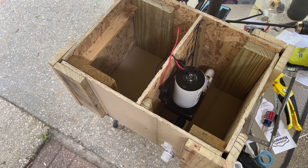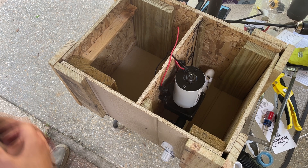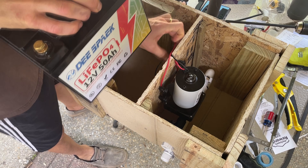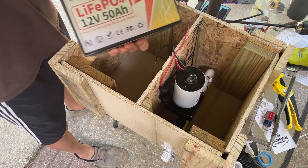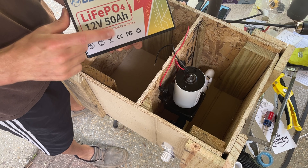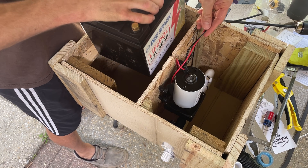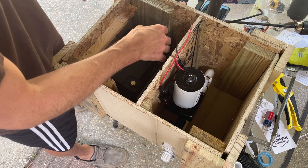Now that we have the pump and plumbing installed we can install the electronics — I'll link everything I purchased in the description below. I went a little overkill with the parts, but after doing the math I literally got five times the system for just a hundred dollars more, which also allows me to expand my system down the road. I went with a 12-volt 50 amp-hour lithium iron phosphate battery since my pump pulls 5 amps. If you want to save a little money you can purchase a lead acid battery instead.